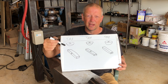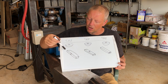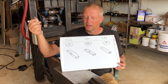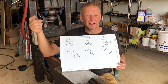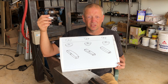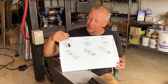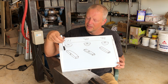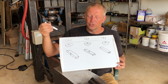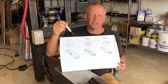Looking at top as spine — this is probably the most common historically speaking. A huge number of antique wootz blades, single-edged antique wootz blades, when you look at them there is actually a seam or crack right down the spine of the blade. This is where that top center has been compressed and elongated along one edge of the bar to become the spine of the blade. The great advantage is you can take your ingot and forge it right out, using the whole thing.